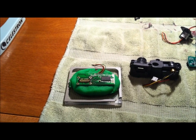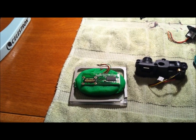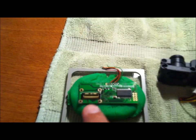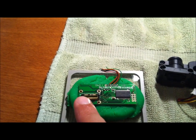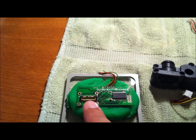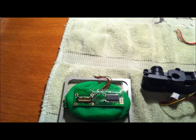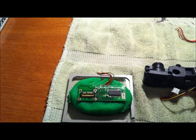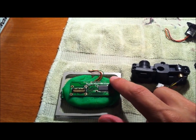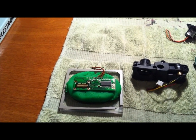So I went online and searched for Panavision. It was real quick once I found it. You can only make a few line scan imagers, and by the package on there, I roughly tried to count between the bonding wires. I guesstimated how many pixels there were and counted the number of bonding wires or pads I could see across here — my guesstimation was about 1800. Then I looked online and saw a 2080 horizontal line scanner and figured that must be it. The package and everything looks exactly the same. The Texas Instruments digital signal processor right there — I'll post a datasheet and part number for it online as well.